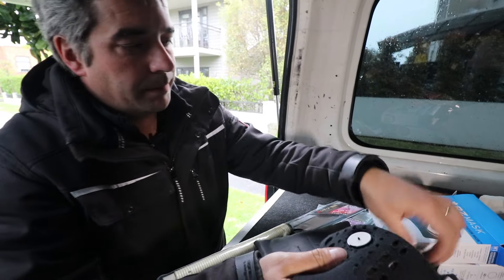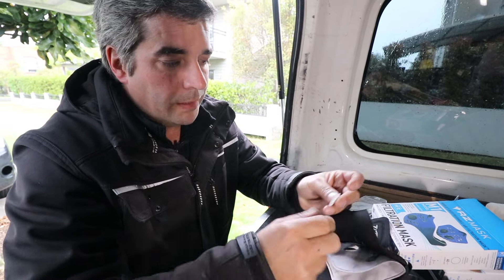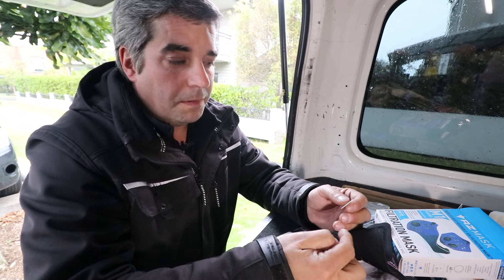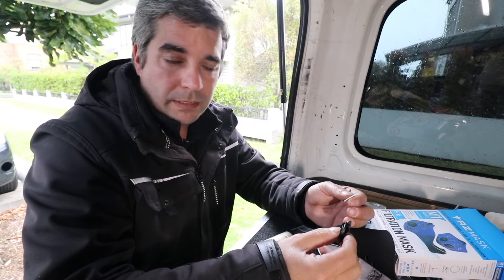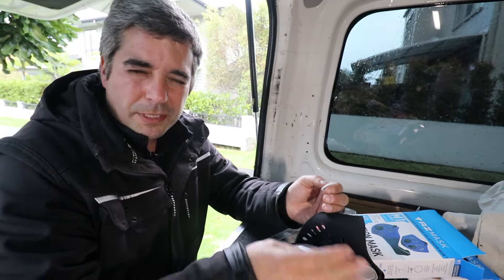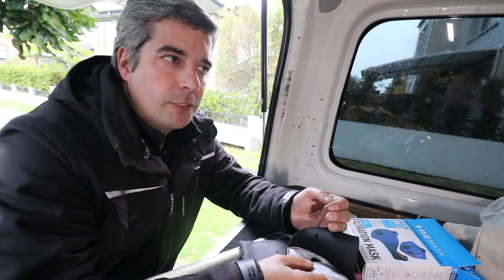You just carefully detach this. Some guys don't realise that this comes off quite easily, and when they take this off to free the filter, if you lose that piece you need to buy a pair of valves because they come as a pair and each pair is 17 bucks. The other thing — some guys are telling their boss they need to replace the valves once a month. It's not true. A filter will last you maybe 40 hours of continuous use, just as an average.